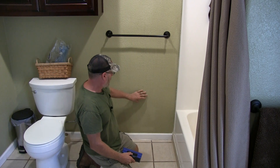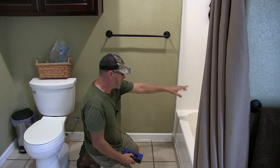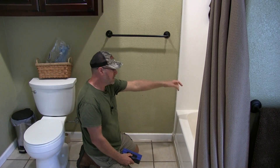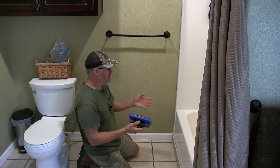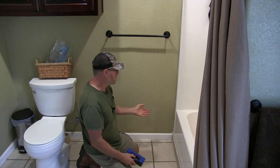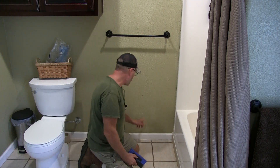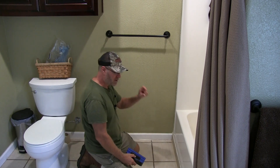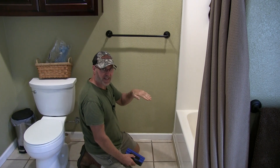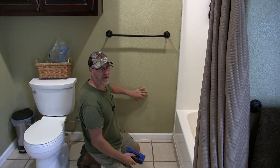I'm on the other side of the wall where the spigot is, here in the bathroom. I measured from the corner of this bathtub — where the corner of the wall of the house was — the 51 inches minus the wall thickness. Figuring the brick and the drywall, roughly eight inches, so 51 minus 8 inches, I made a mark here. From the slab up was 23 inches, minus the tile thickness, and there's probably an inch from where the brick lays up to where the foundation actually is. Subtracting that from 23, I figured roughly 22 — it's roughly in this area.